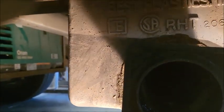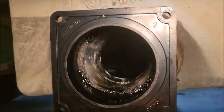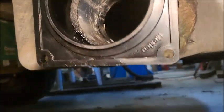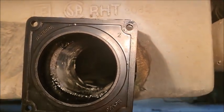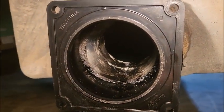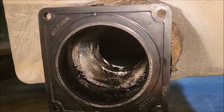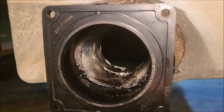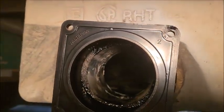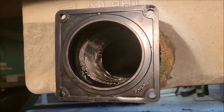I now have my new flange on. You can see that all the glue is dry, front and back, with glue all the way around it. The four-inch pipe is over that three-inch pipe — it's tight and looks good. In hindsight I probably should have added a small amount of three-inch pipe extension equal to the flange adapter depth, because now I'm going to have a little space there for debris to accumulate. But it'll wash out — it'll be fine and it'll certainly seal. I'll assemble it now and show you the final results.